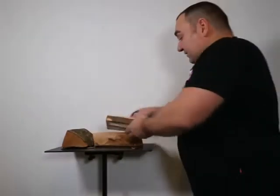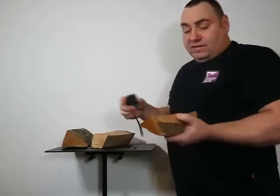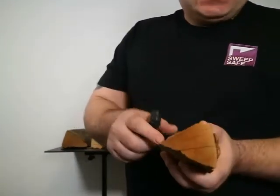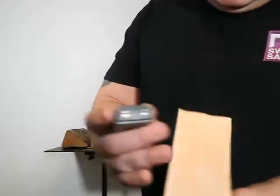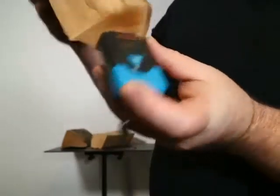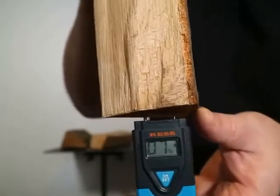What we do is take a piece of wood and split it in the center with an axe. We then test along the grain. If we test against the grain where there's a split, we'll be testing the split, which we don't want. To show you the difference: if I test in the end of this piece of wood — which is nice and dry — it will show 7% moisture. Very low moisture content; it's a nice dry piece of wood that I've had seasoned for some time.